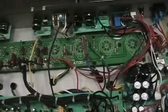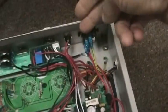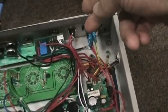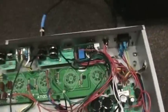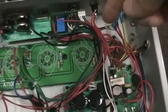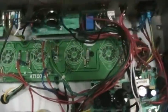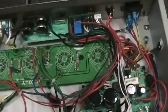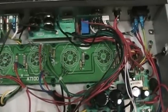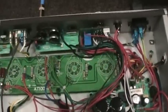The tubes that come with the B52 amp — each power tube is rated at 30 milliamps. So if you did it the fuse way you would get a 120 reading. But you can also connect the common to a ground and put your lead on the number 5 pin of the power tube — any one of the power tubes, since the power tubes come matched. If you're going to change your power tubes, make sure you get matched tubes.